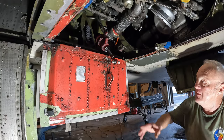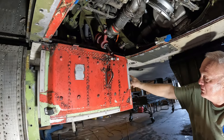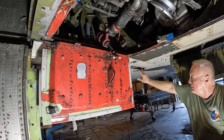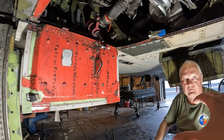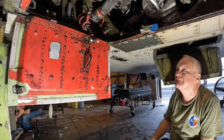That little jack screw up at the top is one of the sway braces. You can see the bottom one here and one there, with two more on the other side. These are for when you hang centerline stores — you can put the centerline tank in and the standpipes here, then the sway braces come down and tighten against the tank so it doesn't rock while flying.